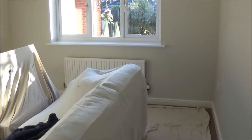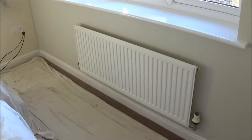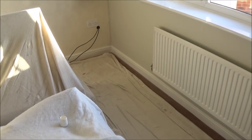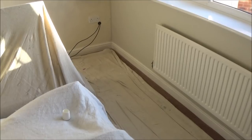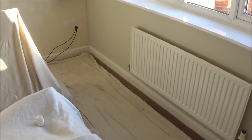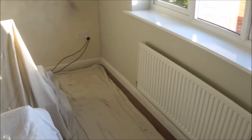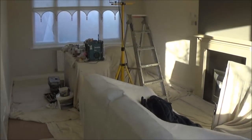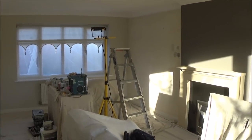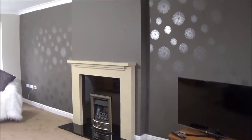The radiators are getting Ronseal radiator paint — that's a water-based stay-white, good stuff. The skirting boards I'm going to use a water-based gloss on them, that's a Dulux, because they were going yellow behind the TV and the couch. The windowsills were okay because they're getting a lot of light. The next time I show you the job it'll be finished — right, that's all finished, wallpaper's on and all the painting's finished.